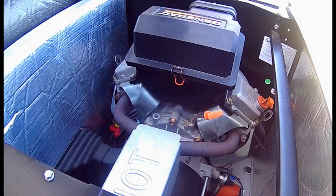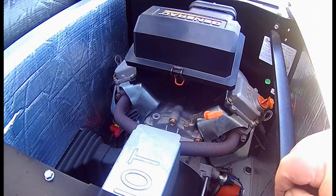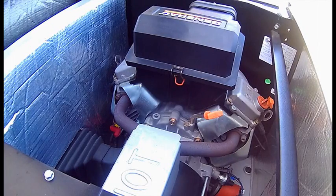It tells you if the battery's low. The battery's automatically trickle charged. Right now it's being trickle charged by a trickle charger, so you're not worried about the battery running low. And like I said, for cold weather, there are cold weather kits: a heater on the oil filter, a battery pad, a heater pad, and the vent tube. If you're 2 or 3 months below freezing, that's probably a necessary option to prevent hard cranking on your starter. You don't really need it if your battery's at 100%.